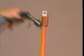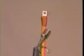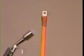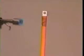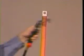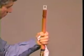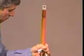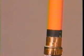Apply heat using a smooth brushing motion, keeping the flame moving to avoid scorching. Work the flame around all sides of the shim, applying uniform heat. If you are working with 5, 8, or 15 kV, no shim will be required. Now, abrade the insulation if necessary to remove any embedded semicon. Then, using an approved solvent, clean the cable as shown. Next, apply the stress relief material at the semicon cutback.